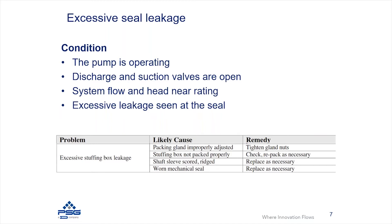If you're dealing with more of a mechanical seal, you can check to make sure that the shaft or the shaft sleeve has not been damaged. If there is a split, score, or nick on the shaft or shaft sleeve where the mechanical seal sits, you may need to replace the shaft or the shaft sleeve so that the seal does not leak near the shaft.